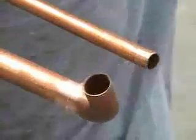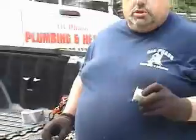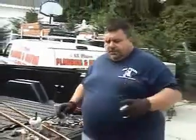Join the piece of pipe like so. Now we're going to attempt to sweat it. The proper way of sweating is to make sure the solder you use — if it's for domestic water, it has to be lead-free solder. There is no lead in this solder, so nothing can harm you in any way. And if you're doing heat, you use a 50-50 blend solder. Then you can use it on heat because you don't drink that water — it stays within the system.